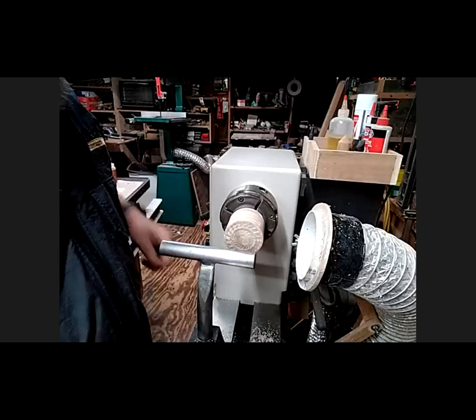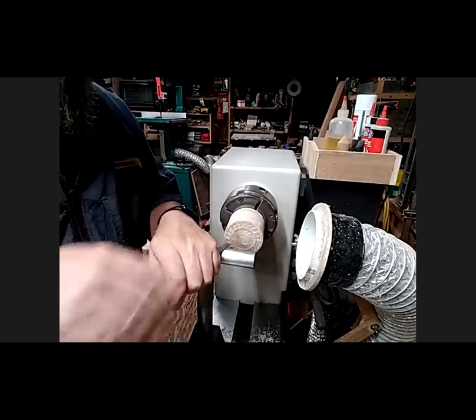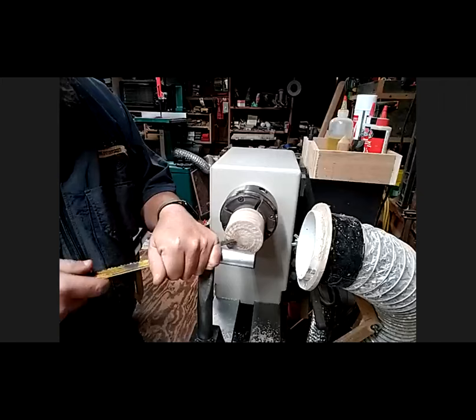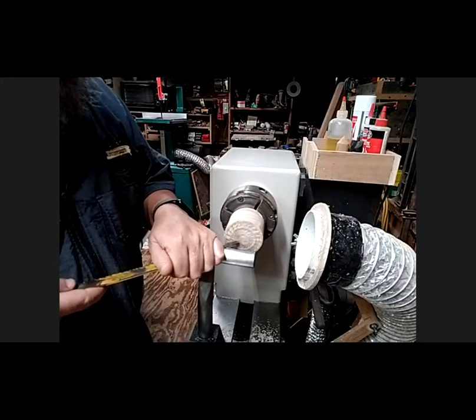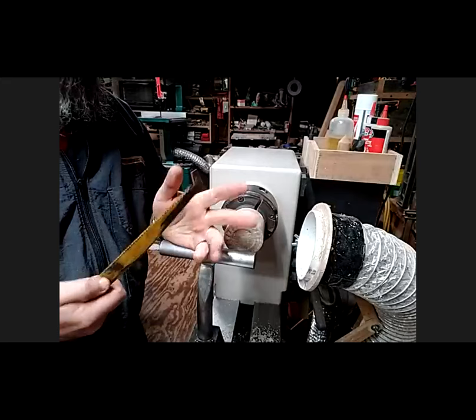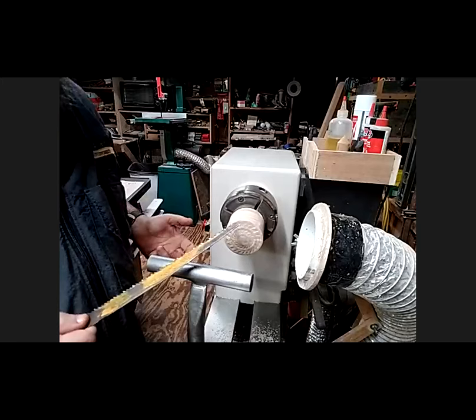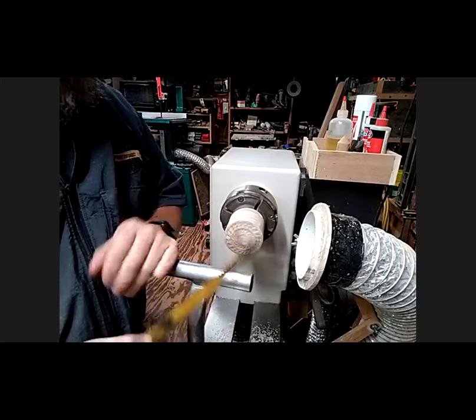That's great, Steve. So is that working because that blade is flexing, or how is it even making that pattern? Yeah, it's creating chatter, just like if you drug your gouge across here in a pull cut or a shear scrape, and you get that chatter, if you notice, it always leaves a spiral. This is doing the same thing, but it's a scraper that just flexes, and it just chatters, and that's all it does. That's why when you pull your tool rest further back, you get a completely different pattern, or if you change your lathe speed, you'll get a completely different pattern. But I've used this thing for years. I mean, literally years. I made that spin top nearly 10 years ago with this tool here. And it's the only texturing tool I've ever had.